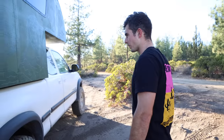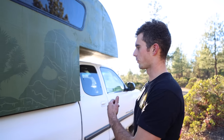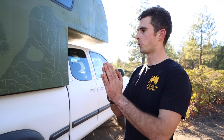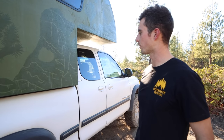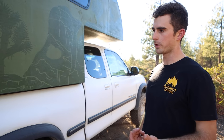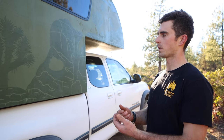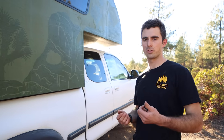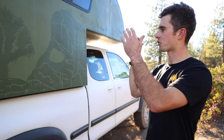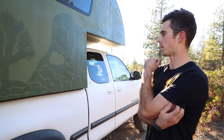So this is a whole new design, I guess. I was trying something new with this build, and I wasn't sure how it'd work. The idea was to minimize the wall thickness to allow for the most room inside to, like I said, sleep width-wise. So I used 2-inch studs from 3/4-inch plywood, and then it's sheathed with 3/16-inch ply, and then I used a method called poor man's fiberglass, which is where you roll wet wood glue, put on painter's canvas, and then wet wood glue on top, and I sectioned it out piece by piece. Eventually, I coated the whole thing with this PMF.